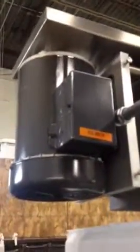Moving around the back, of course, this is your unscrambling table. I'll just go really quickly because it's really simple. It's basically on and off right here, and then there's a speed dial right here for how fast you want to run. It's just 110 volts to turn that on. Very simple. Okay, so going to the back here, this is your fill motor in the back. This is what drives the clutch brake. It's just a 220 volt motor. Very simple.